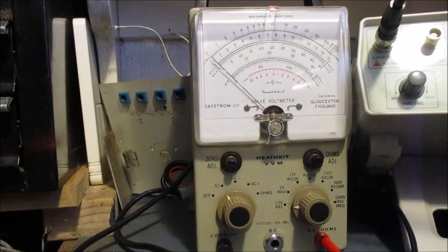I know my setup here looks very much Heath Robinson. The long and short of this is, I'm a thoroughly disorganised person. My wife would eagerly verify that particular point. Unfortunately, the video editing I use doesn't have picture-in-picture facility, so I'll set my camera onto the VVM whilst I begin by adjusting IFT2 trimmer capacitors and then move over to IFT1 trimmer capacitors, which of course is the front end. Right, I'll begin now.